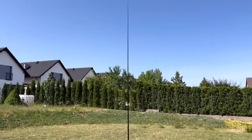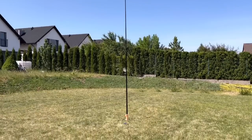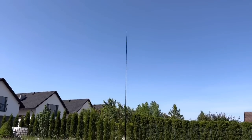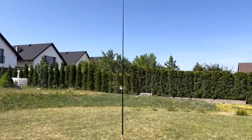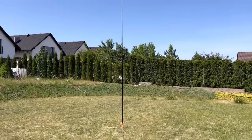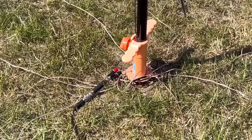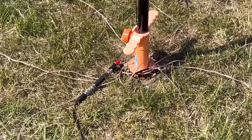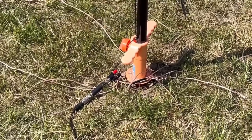Okay, here we go. That's better. Even though it's still windy, it's nice and straight. That's cool. That was 119 zloty, which is about 32 U.S. dollars. It's like I've got the top part of a DX Commander there — really cool pole, nice and stout, not moving in the wind. Now I've got a quarter wave ground plane for 20 meters. I removed the 4-to-1 balun and put a banana clip with my little 1-to-1 balun to it now. It's officially a quarter wave ground plane for 20 meters.